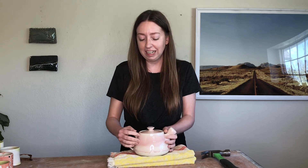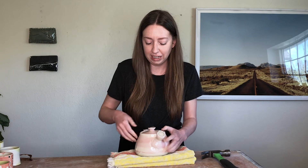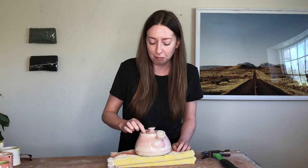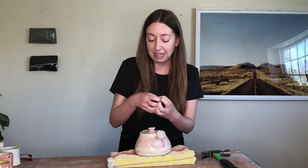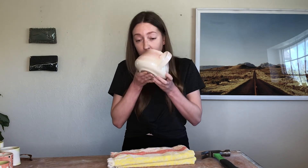There are a couple of good things here that make me think this might have worked. One thing is I can hear where the stuck part is — it sounds really flat, no reverberation — and then over here it's a little more tingy, which makes me think the seal might have weakened right there so I might be able to work around those areas. Also, I can blow air through it, so I know there is some part that's not completely sealed. I can't feel exactly where the air is coming from, but it's a good sign.